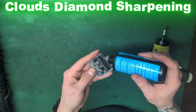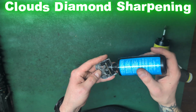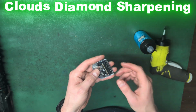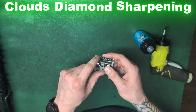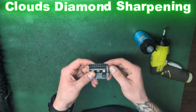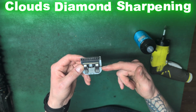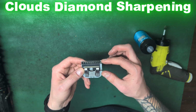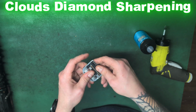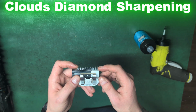We're gonna oil the blade, put a little oil across that, a dot back there, and a dot back there to keep it from melting and keep this from wearing out more than wearing out up over here. Because if you don't oil the back here, the blade tends to go out faster. You want to keep these even. If the two running surfaces are even, then you get more cuts out of your blade.